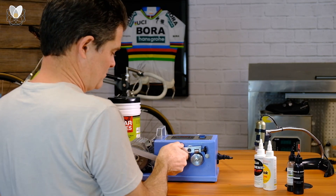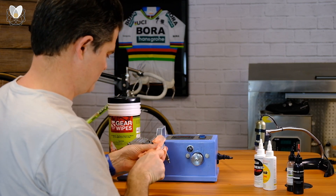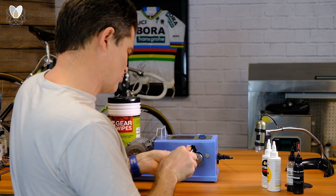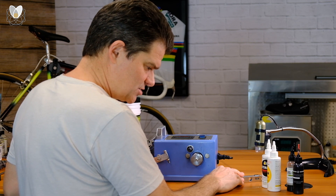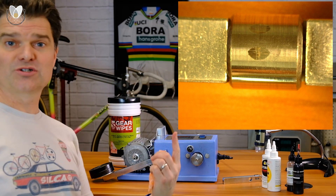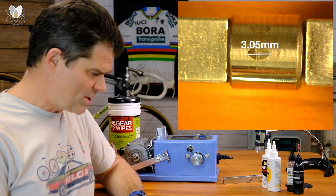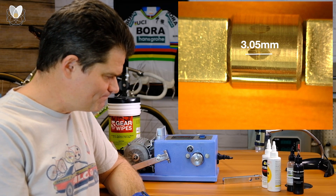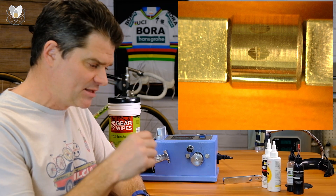Stop the timer. Once again I have to say I am pretty impressed — not bad, ProGold. Let's get this wiped and get it under there. There is our second scar right on top. Michelle is going to drop it right there. You can see that's again about a 2.5-millimeter wear mark. I can't say I see a difference between the two products. Interestingly, there was a little more flinging from the Xtreme, which is kind of the opposite of what I would have expected. Let's rotate it, clean wipe, throw some Synergetic on it, and see what we get.